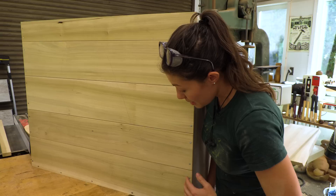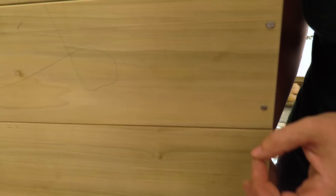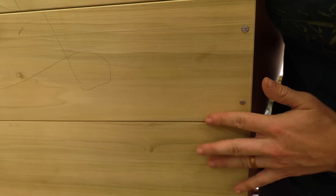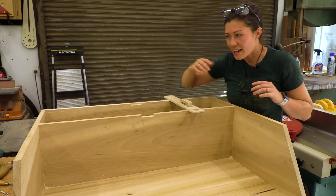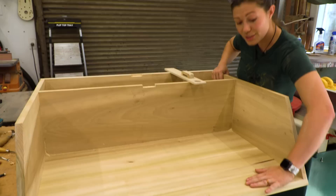Another step that I did just because I love the way it looks is that I went in and chamfered each one of these with a chamfer plane. There's going to be a little space anyway because you used a spacer, and I feel like that looks a little tacky if you don't create some other visual interest around it, so the chamfer plane makes perfect sense. A quick structural note: yes, my bookshelf design only had two dovetails on either side, which is potentially weak, but we're going to have nailed portions on both the back and the front sides, which will alleviate any potential for racking.